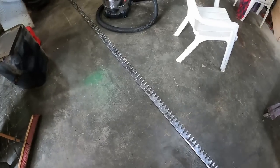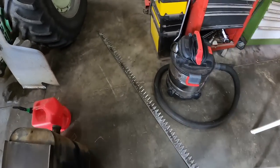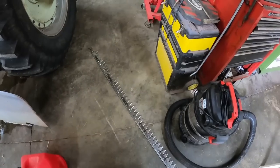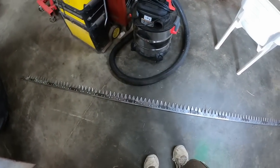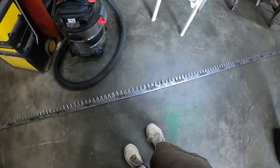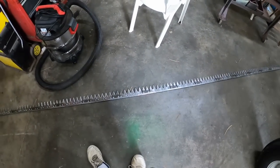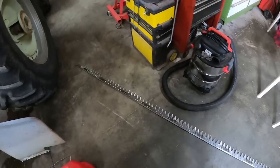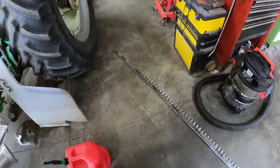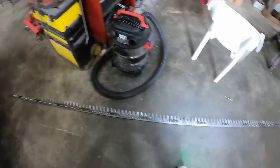Well, it's been a couple of days since I was working on this. I was able to get wheat finished last day, and it was humid as all get out. Running in a low area with some down wheat, so I haven't got her right by the ground. And with all that humidity, stuff was just tough. And then, throw in dull knives and worn guards I should have taken care of sooner, or, well, haven't yet. And all of a sudden, stuff ain't coming in.